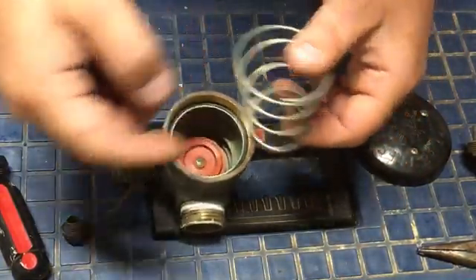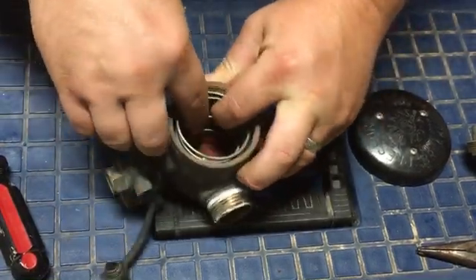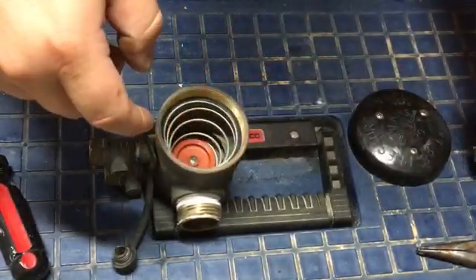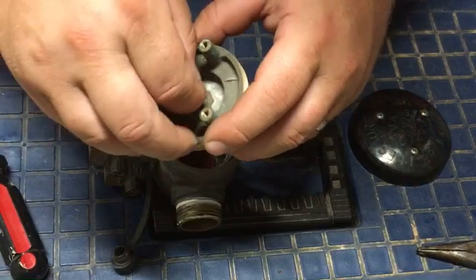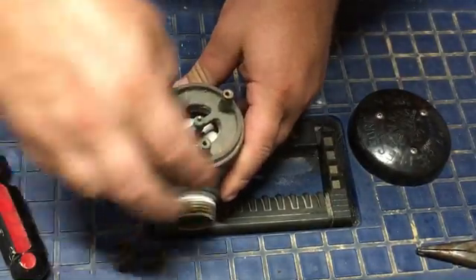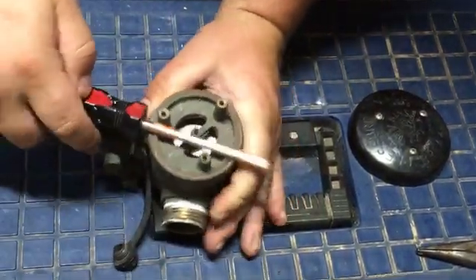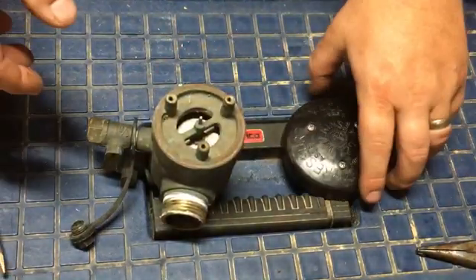Get the bottom check to line up. The spring is a little tricky but it's not bad — I do have another video on this of me rebuilding one out in the field. Just work your way around until the whole spring is in. Once that's in, take the poppet, the washer, and the bonnet — you can grab it by the pin. I don't lube the other parts, though I sometimes lube the lower check valve where it seals. The poppet I definitely don't lube, because it needs to fall less than a one PSI difference.